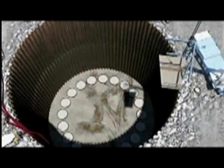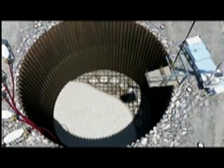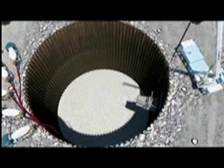The core is concrete, and at the base very thick concrete — about six and a half feet thick, starting at way down deep, around 70 feet down. We're going to pour a circular mat foundation to tie all these caissons together. And after that's poured, we can then begin our core wall — the concrete core wall.